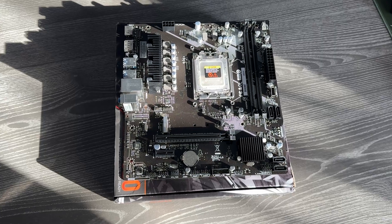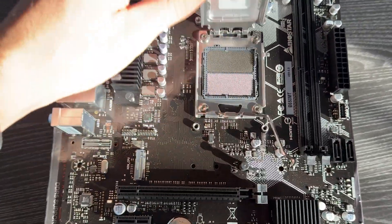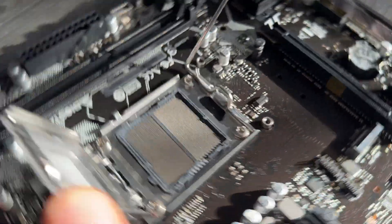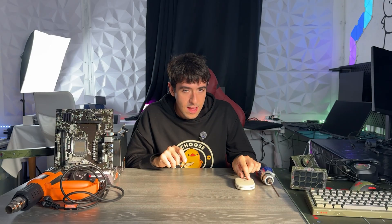Once the pin is visually in position, it doesn't have to be aesthetically perfect, because since the pins were bent, the light will still shed differently on them. I recommend you only watch the top of the pin — not the center, which will shine differently either way. Make sure the top lines up perfectly in both directions.